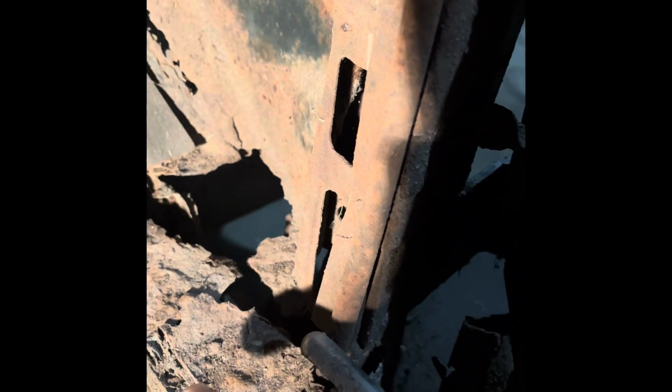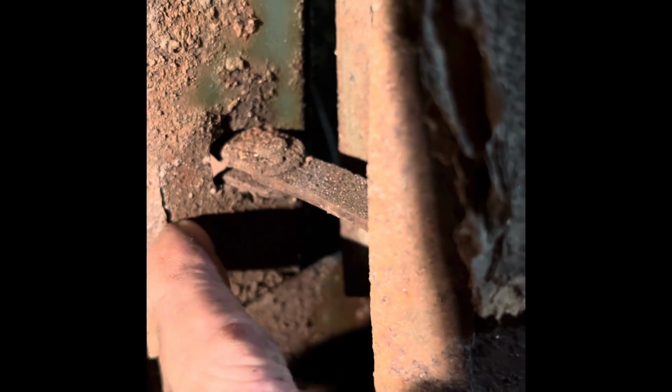So, what all exactly is going on here? The foot of the A-pillar is completely rotted off. There's nothing holding that. So I'm gonna grind that bolt out. Come up here, bend me a plate of some kind. This here, where the bottom hinge goes on the A-pillar, all the structure's bad in there. However, it does look pretty good as soon as I get to here. I think I can probably, well, I don't know. There's a crack there too. I don't know how high I'm gonna have to come there yet. Be best if I come clear up in here somewhere, but I don't know.